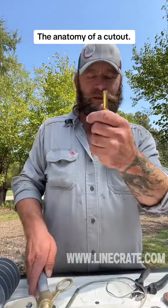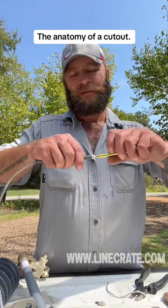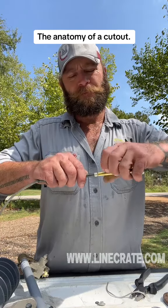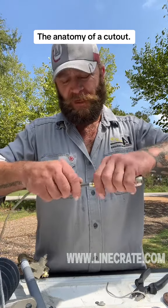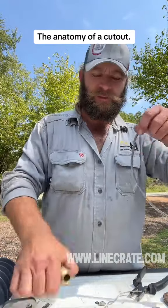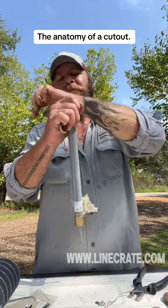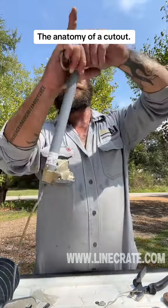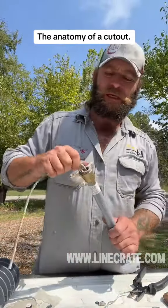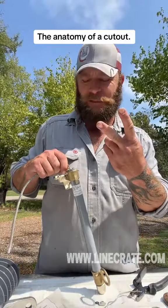The cap's got a shaft on the end of it right here, so what you do is take this piece off and screw this little piece on right here. A good little tip is to get your wire straight — them kinks can sure be a pain in the ass sometimes. It's simple, y'all all know this part. Put it in here, put your cap down on, get it tight. You want to tighten your cap first, because if you run it down here and get it made up, then tighten your cap up, what you're gonna do is twist your fuse up and it's gonna be slipping, slack, and loose.